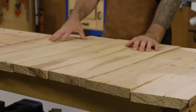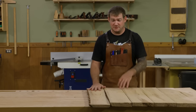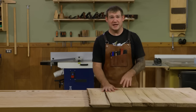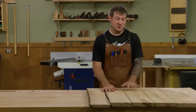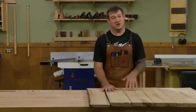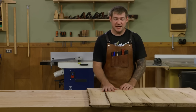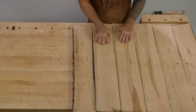When you're cutting stuff like this it's going to be pretty rough depending on what type of blade you have in your bandsaw. This one cut pretty well — it's just a standard 3/8-inch wood blade. There are green wood blades you can purchase for your bandsaw, and if you're going to be doing a lot of this I would highly suggest it. They're going to be a little more coarse and cut the wood more efficiently than a blade like this, which has probably too many teeth for soft, wet wood.